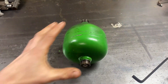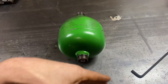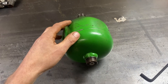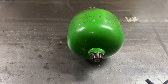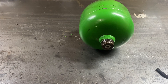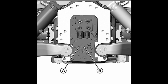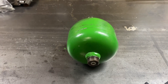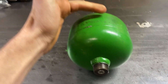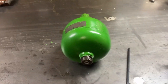This accumulator here is the top one — the rod end off of an 8220. On the 20 and 30 series, it's really hard to check because it's straight off the block with hoses and rads right there. The base end, which are the bigger accumulators, are underneath and you can get them flopped down enough to get your tool on. You'll have to release the hydraulic pressure first. On the 20 and 30 series, the valve block is underneath and has a hand-turn fitting to release pressure — the suspension will drop. The 8Rs have two different screws to turn, or you can go into SFA address 21 to release the pressure. The pressure has to be released, otherwise you'll be reading 1200 or 1300 PSI because hydraulic pressure is acting on the accumulator and inflating the nitrogen reading.